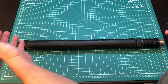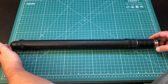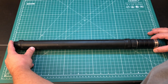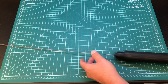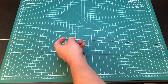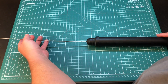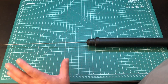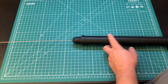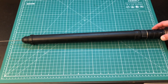Let's take a look at the actual antenna. Here we are in its collapsed form. The base of the antenna is about 21 inches long and roughly an inch and three-eighths wide at its widest part — so not very big. Then you have this stainless steel whip that is just about 35 inches. When I initially saw this antenna, I didn't think there was a way to remove this whip if something were to happen to it, but there actually is. So I want to show you how to tear this antenna down really quick. I need to run outside and actually fully extend this so we can remove all the parts.